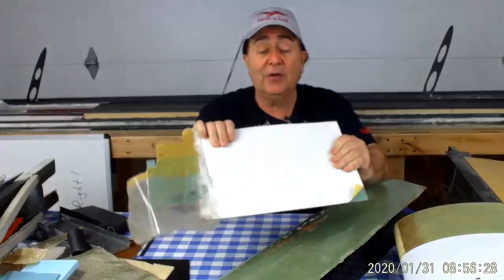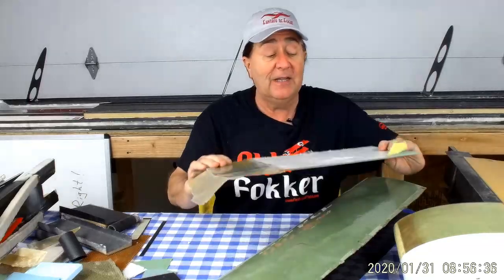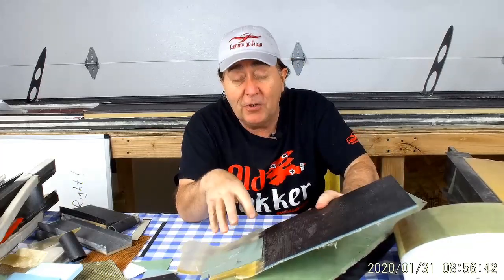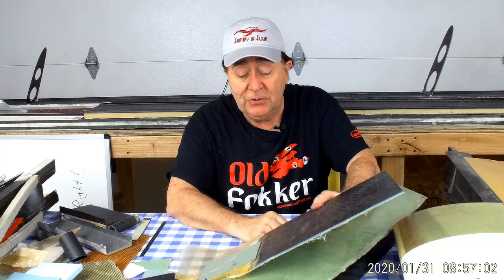I thought I'd bond a sheet of foam on the inside to keep it from tearing, but the foam cracks — that's a problem. You can see how that process goes: the sandwich panel worked flat but I wanted to make it curved, and I was testing peel strength. I also tried the traditional method using female molds made out of styrofoam with a mylar inner surface for a smooth finish. Long story short — much work, never worked. Things would slide around in the mold. Bad plan.